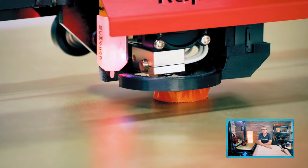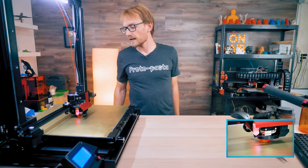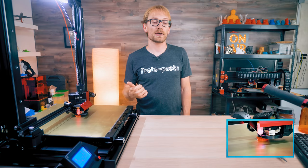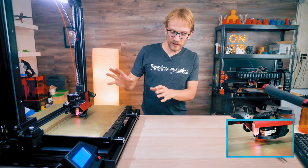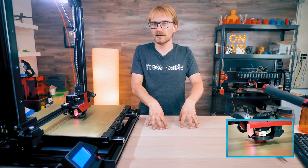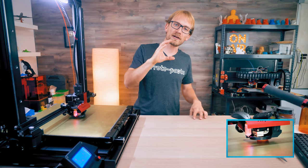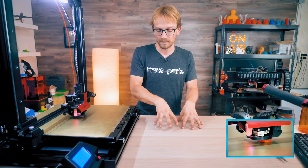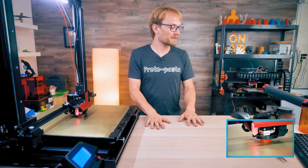So how loud is the printer? Motion is actually really good. Motion is fine. Motion using the Trinamic TMC2208 drivers is kind of quiet. You do hear a bit of vibration because this desk is, again, that IKEA sandwich panel, which is a thin panel on top and then that honeycomb in the center. So you can hear how loud that is. It does kind of amplify vibrations.